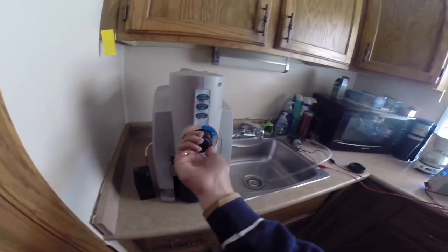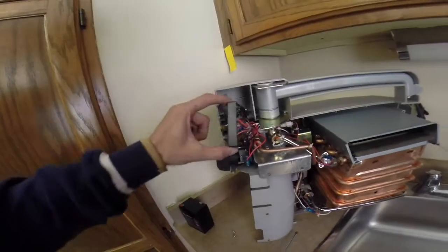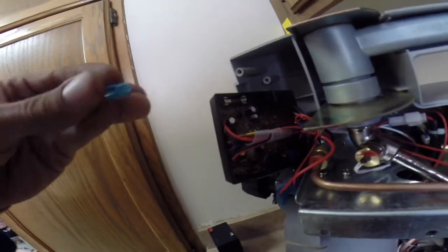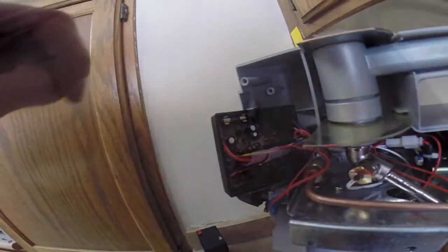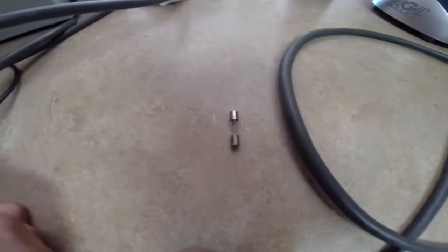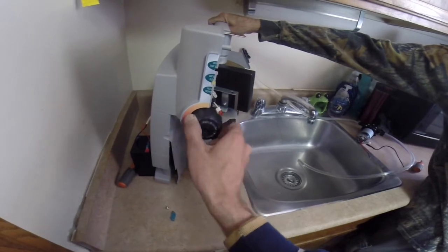The other unit — nothing. I think this one's got a dead fuse. The fuse location is inside a little box, covered with a small seal. I grabbed some needle-nose pliers, grabbed onto the top corner and pulled the whole fuse and seal out. This fuse is done. It reads F4L250V — that's a 4 amp, 250 volt fuse. I found a 5 amp in my parts bin, so I hooked the battery back up and we have life.